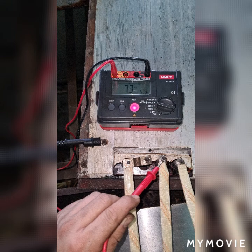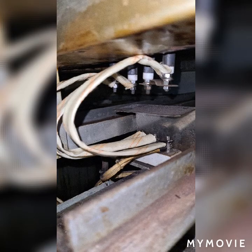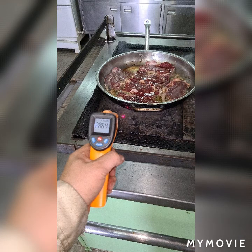After doing this, I make a megger test and I have here 56 mega ohms, 77 mega ohms, and also 100 mega ohms. I arrange the steel conductor plates, and now after repairing, my electric range is working very good. I've got very high temperature — the chief cook is happy cooking daily food for the crew.